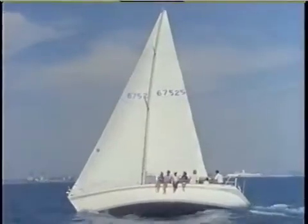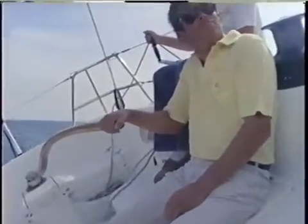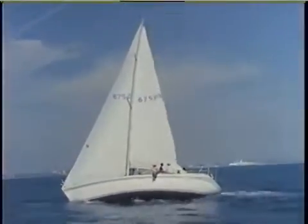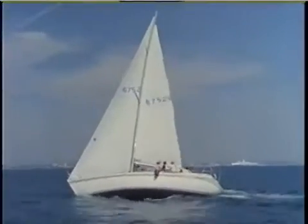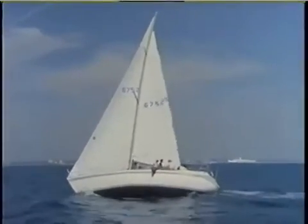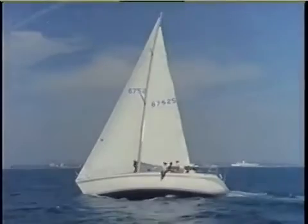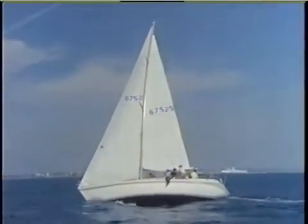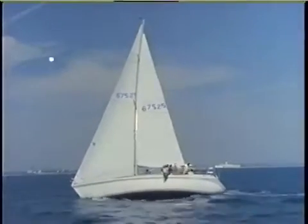When the breeze increases to the point where the boat is consistently heeling beyond 26 or 28 degrees with the proper headsail set, the main flattened, and the traveler car off center, the fastest way to get the yacht back on her feet will be to reef the main. With her main reefed, Fast Company has less sail area and a lower center of effort, so heeling force is reduced. The sail is flattened as well, so the shape is faster for heavier air sailing.